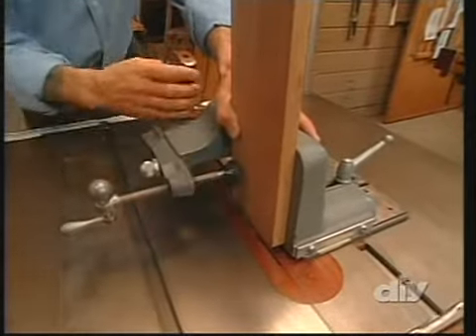Welcome back. Our project is this classically designed nightstand made out of quarter sawn white oak. We've made all the pieces for our framework and glued them together — now we're ready to build the drawer. We used half inch solid maple for the drawer sides because it's strong, stable, and easy to work with, and eighth inch maple plywood for the bottom. For the drawer front, we cut a piece of quarter sawn white oak and attached it so it'll match the rest of our nightstand. For our joinery, we're going to be making a locking rabbet joint — relatively easy to cut but strong enough for our application.